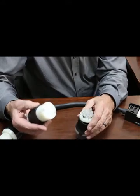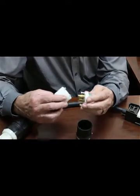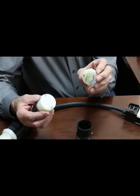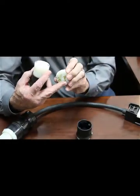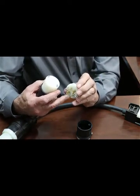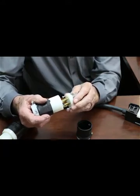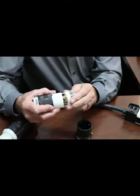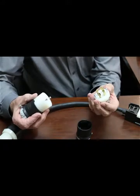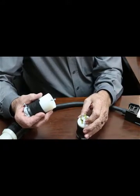This is our three-phase to single adapter. Notice it's got the specific ends on it. We'll also show a picture of the chart that gives you an idea of the different ends and the different NEMA classifications and how it works. If you get everything lined up, it goes in and then twist-locks — that's how it fits together as an extension cord.